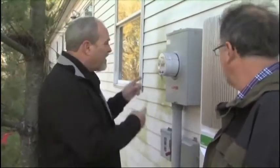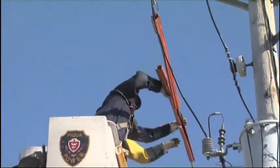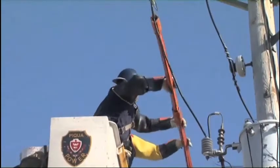Now, if you have an outage, or for some reason a storm, something in the utility goes away and that grid is not there, the inverter realizes that and immediately disconnects. So at that point, you can't send power back to the utility. You can't put a lineman in danger or anything along those lines.